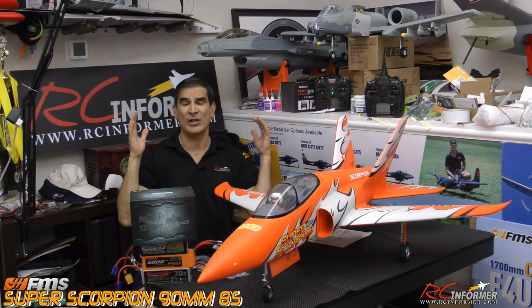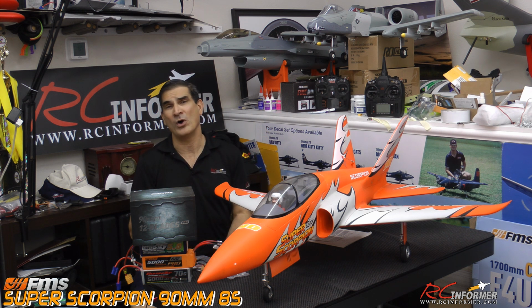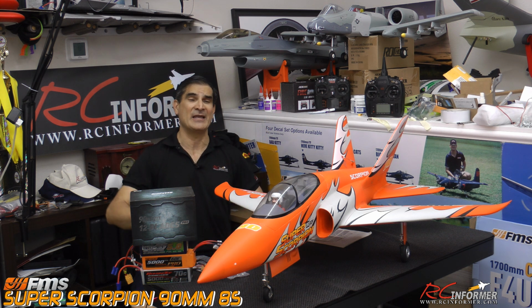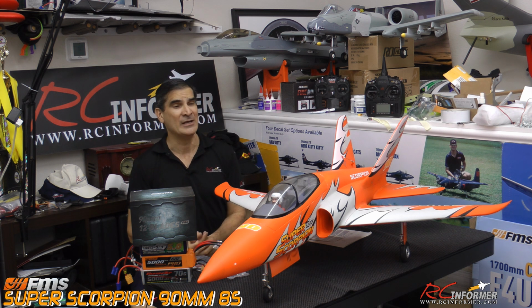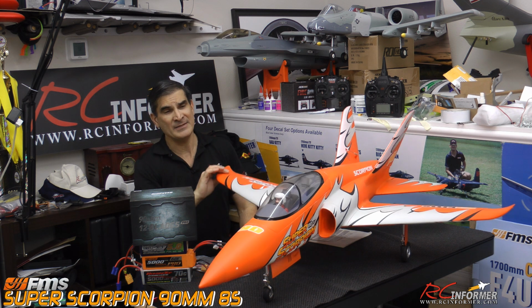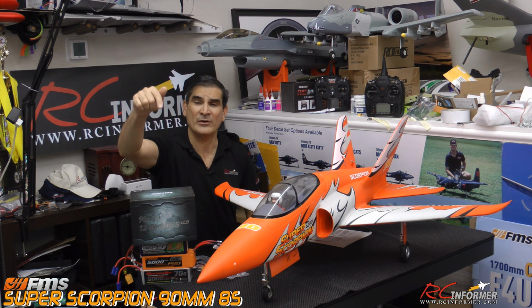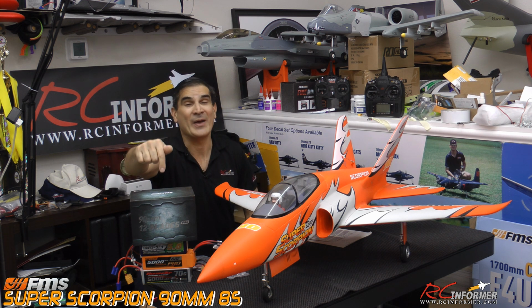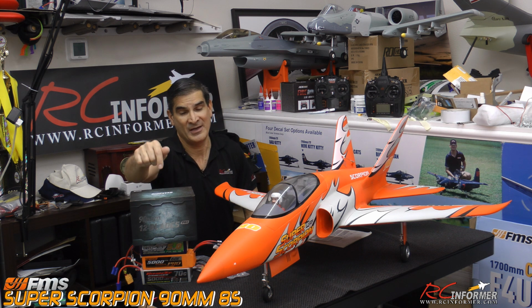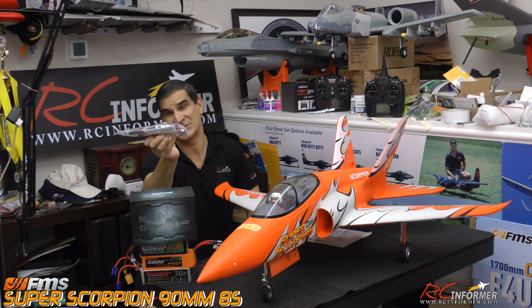Today's video, I have a long-awaited upgrade to the FMS Super Scorpion. This is something that I've wanted to do for the longest time, but just haven't had the time to sit down and do it. But we're going to get it done today and show you how to do it. We're going to take the FMS 90mm 6-cell powered Super Scorpion and convert it to 8S using FMS's 90mm Pro Series metal fan, and we're going to upgrade the ESC to 120 amp, which is FMS's 8S ESC as well.